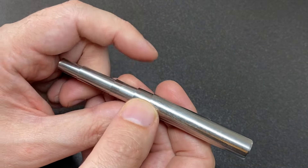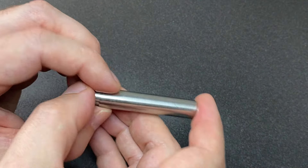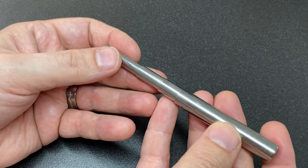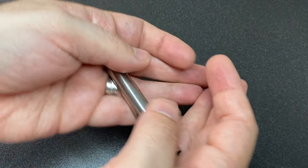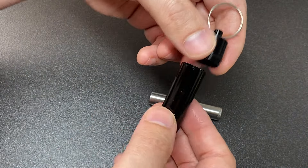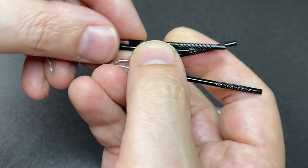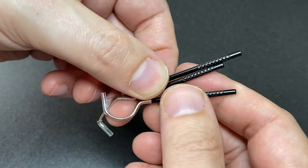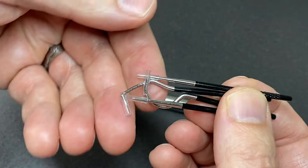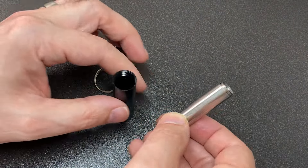One way to find out — should just be able to slide this out. Let's see how it works with the 10 millimeter one. I'm going to use a shim because the groove for the circlip on the tailpiece is quite wide on this. Put that in there and just gently push it out. And there you go. These concentric followers are just so easy to make. If you've got a cut-off disc tool, be careful if you're using a hacksaw that you don't compress the thin wall tubing too much. Obviously take all safety precautions — I was wearing a mask and goggles at all times.